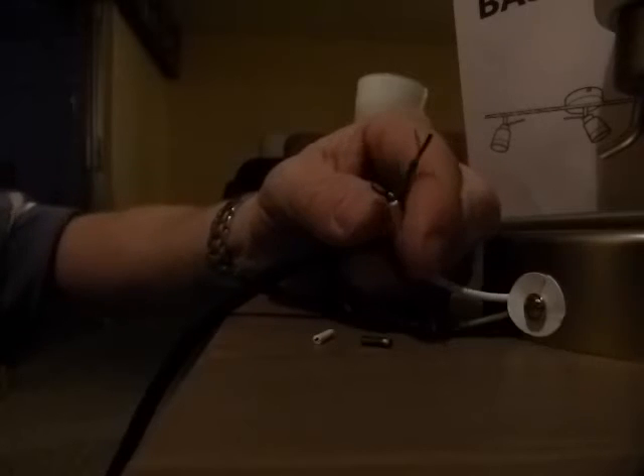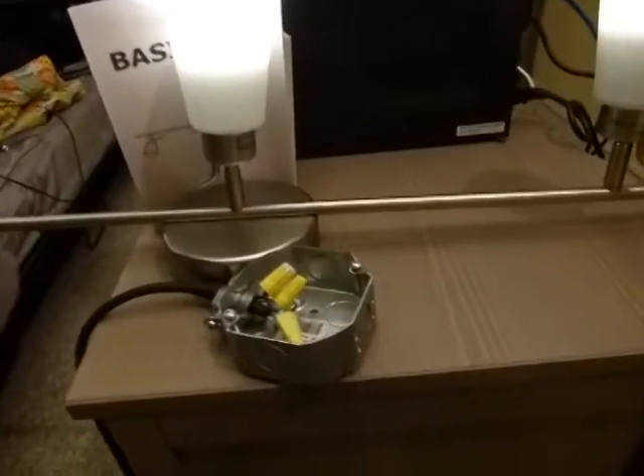I'm going to connect them and then use a plastic cone. I'll make my final connection inside this box — this is just to show you what happens inside the box because it's hard to see. Hold the two wires together, give one twist so they stay, and then thread the yellow cone on — it's threaded the other way, so run them together like so. There they stay together; that's pretty strong, but it doesn't withstand a whole lot of yanking. That's what goes inside this box.